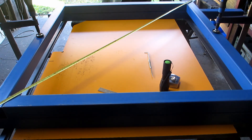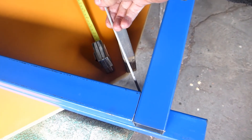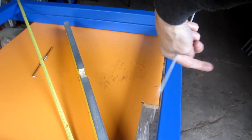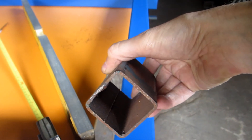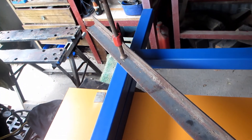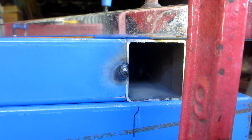With diagonals, you only have to slide the side half the amount of the difference — if it's 4mm out, slide the side 2mm. Here's the fun part: any weld will pull this thing out of shape. If you tack the tube on the inside at the middle, the weld will shrink and pull the tube left. If you tack on the outside in the middle, it'll tend to pull the tube right. Tacking middle-top will tend to roll the tube anti-clockwise. You can clamp it or change the angle in the opposite direction to account for the pull, but either way you'll have to constantly check and manipulate it in your favor. I tack the middle outside of the long side so when the weld shrinks it pulls the tube open on the far side, making that dimension bigger. I then tack the outside middle of the other corners in an order that keeps the whole thing square.